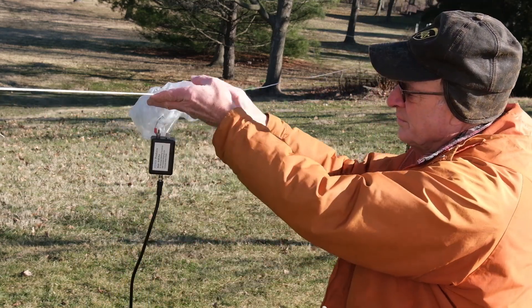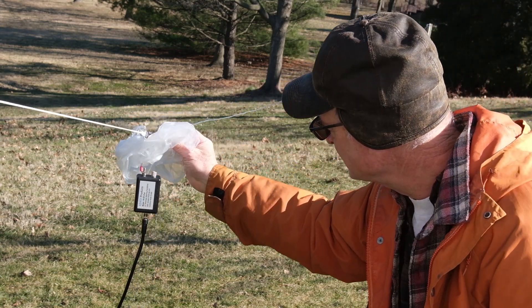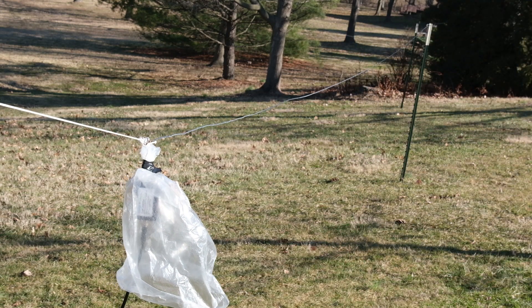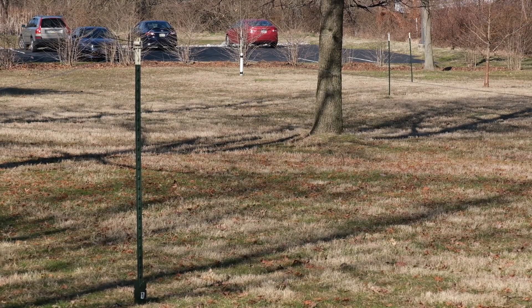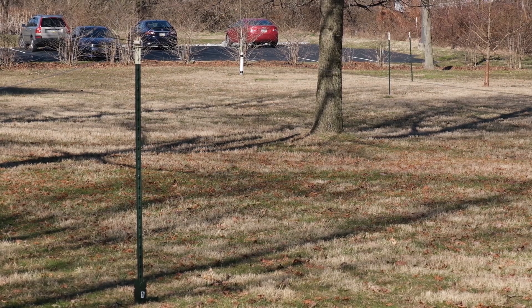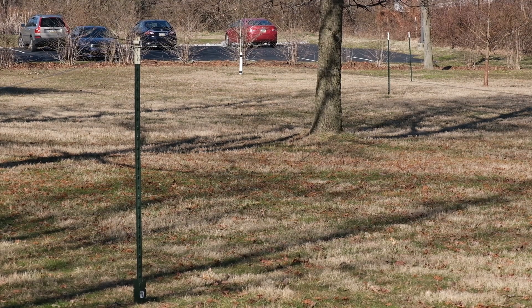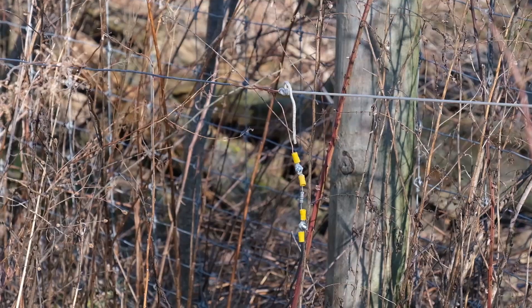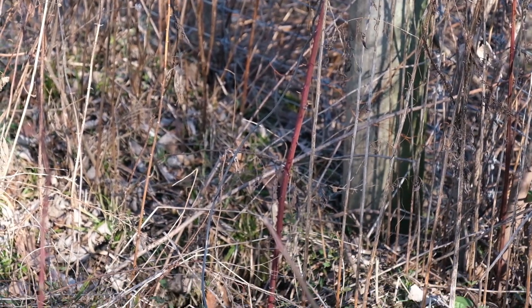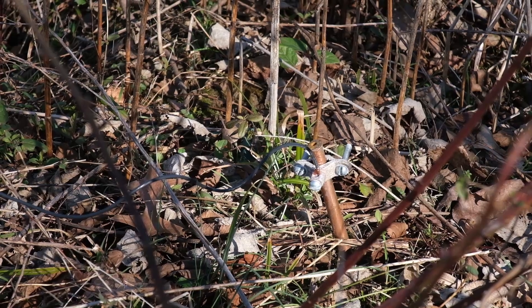The downside of any vertical is that it's noisy to listen to. I have one beverage that starts at my cousin's barn and runs 500 feet across my lot and onto my neighbor's lot, facing northeast toward Europe. The other starts at my tower and goes across my cousin's lot onto a doctor's property, so my beverage looking toward the west is on the north side of his parking lot. I really need to entitle this video 'In Praise of Good Neighbors.' I learned to appreciate how pleasant it is to listen to 80 and 160-meter signals on those beverages with so little noise.